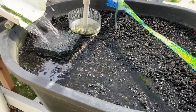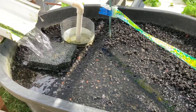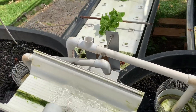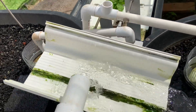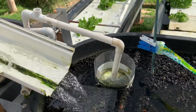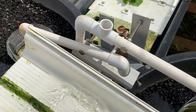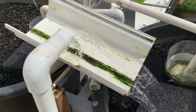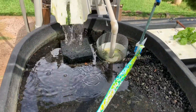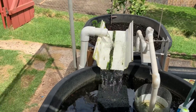The flow out is important because we want the flow out to be a little bit smaller than the flow in so that it fills up. You can see here it's getting to the top, and once it gets just above that cinder level, it starts to pour over into our cylinder. That then presses down on the other side of the lever and flips it to the other side. I noticed that I needed a much greater range of movement on this side in order to give enough strength to flip this small lever. It's not a one-to-one thing — if you're doing a mechanism like this, it'll get stuck in the middle and you need greater leverage.